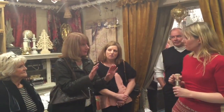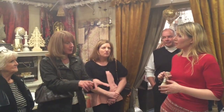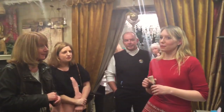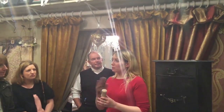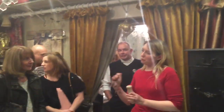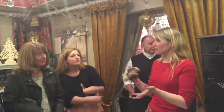If you decide to rub parts of it down to get a shabby chic look, at what stage should you do that - before you put the clear wax, or if you're using both waxes, which stage? This is the big debate. Annie would say definitely wax before you distress because then you have more control. I personally prefer to do it before I apply the clear wax because I prefer a bit more of a distressed look using sandpaper, but you can do it either way - it really is personal choice.